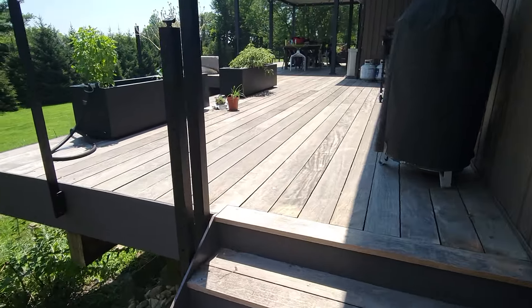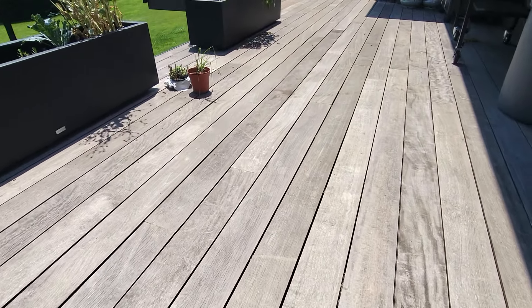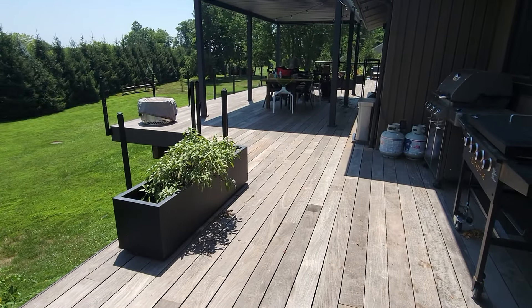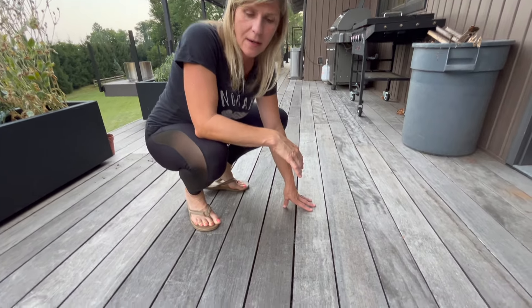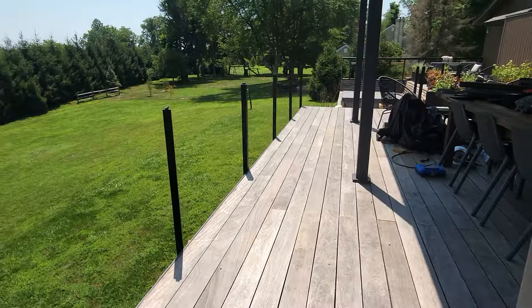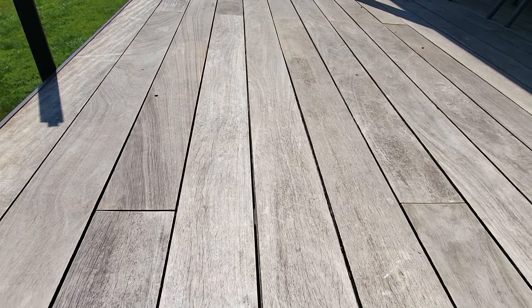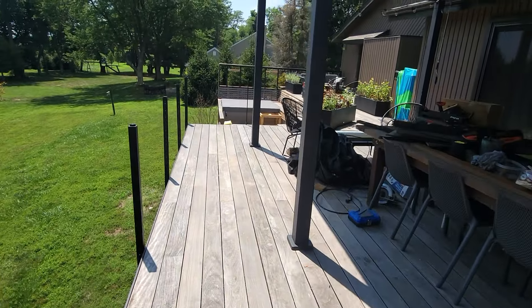The reason we knew this material would work is because this is ipe, which is known as ironwood. It's a very fine-grained wood, also known as Brazilian walnut, and it doesn't have many splinters. It's very fine and it lasts for up to 100 years. This was installed previously at a country club and it already had this sort of gray patina. You don't have to finish it, so we knew that would work and we just like the way this looked — already weathered and patinaed over time. We're going to leave it as it was and let it patina more; it should last our lifetimes.